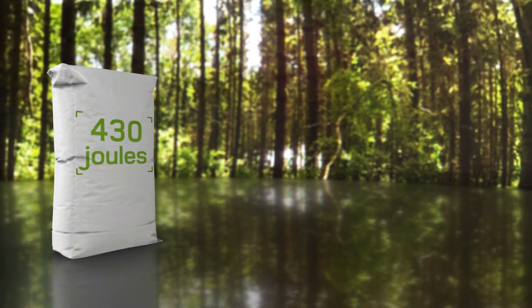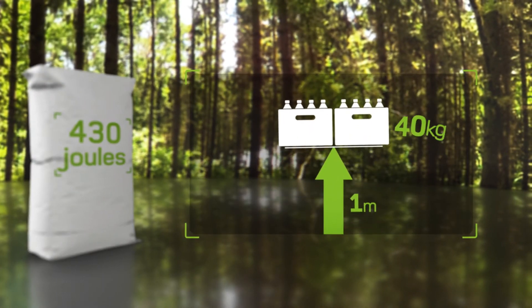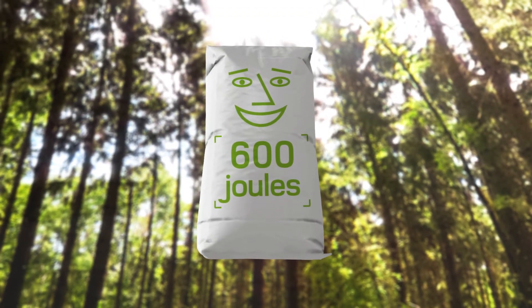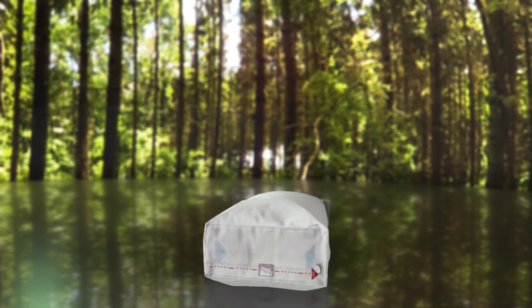This is similar to the energy needed to lift more than two crates filled with glass bottles. Particularly tear resistant paper sacks have a TEA value of up to 600 joules, allowing them to withstand hard shocks and drops from a height of more than two metres.